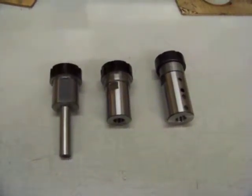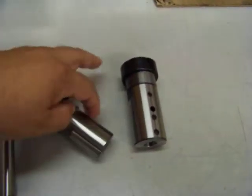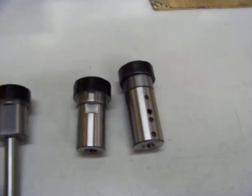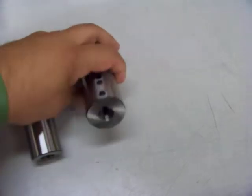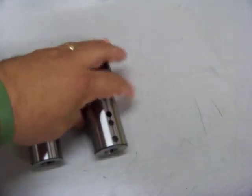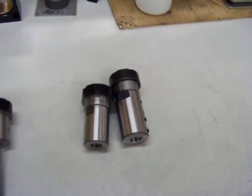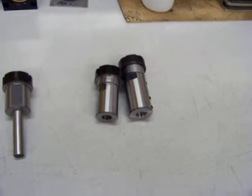The J33 taper version is to be loaded into an automatic drilling fixture, a self-feeder, or a drill press. On the far right is an ER32 collet chuck with a motor shaft adapter — this will go right onto a 5/8-inch motor shaft and allow you to attach a chuck to a motor. This is a new product for us.